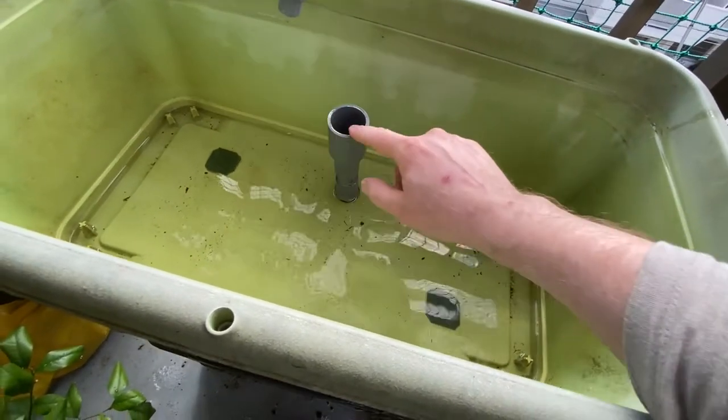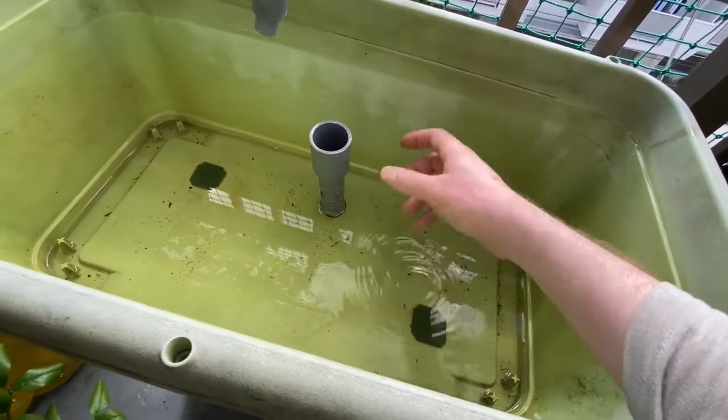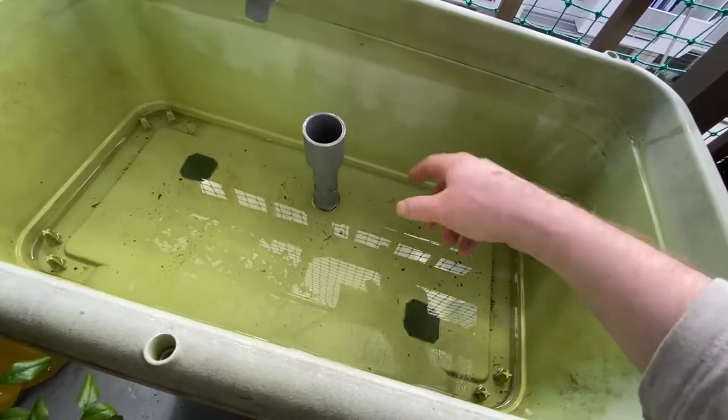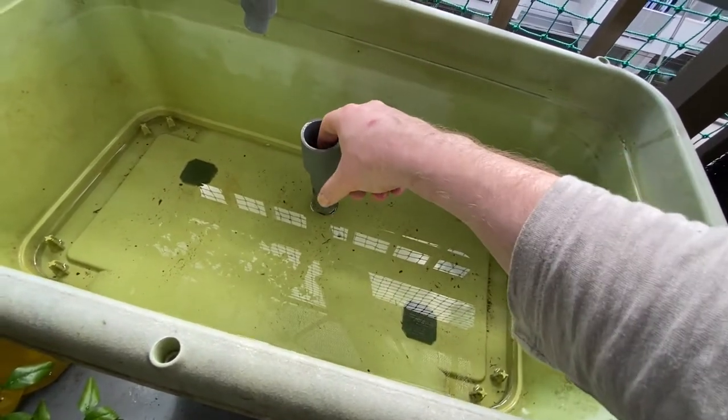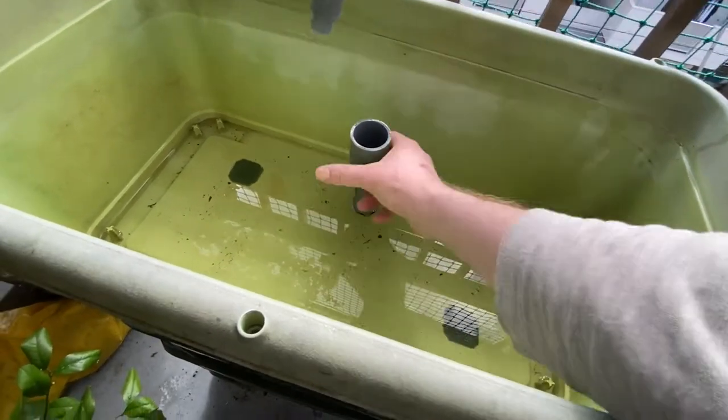The reason why it's expanding at the top is it's easier to get the bell started because more water can flow over, because you have a wider surface area that the water can go through before it hits a narrow part of the pipe that creates the initial suction that gets everything started.